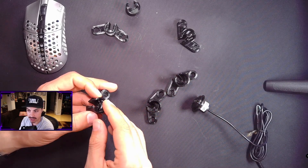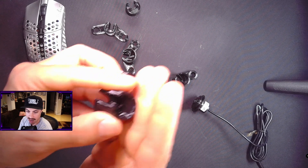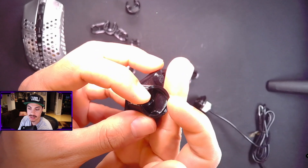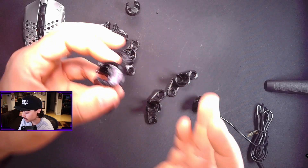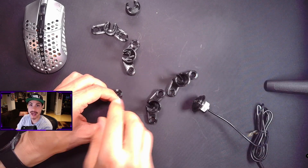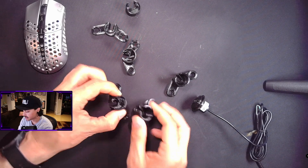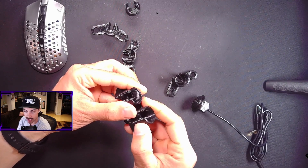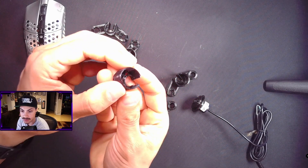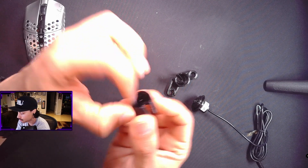With a plate of even just six of these, that bottom layer there is the very first layer of the overhang. It would do the layer, then move and do the next piece, next piece, next piece, then come back and do the layer on top — but by that point it had time to sag and move away. You can see it's pretty much identical in depth, just on an angle. You can also see it from the bottom — there's still a little lip visible.